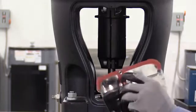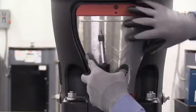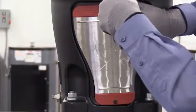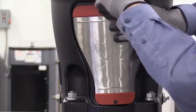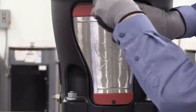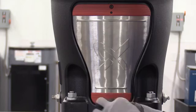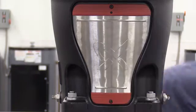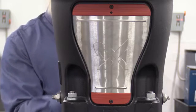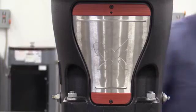Place the shaft seal spacer tool back on one of the coupling guards and reinstall the coupling guards. Then using a torque screwdriver, either with a T26 or a slotted head, torque to three foot pounds. Put the one back on the back.